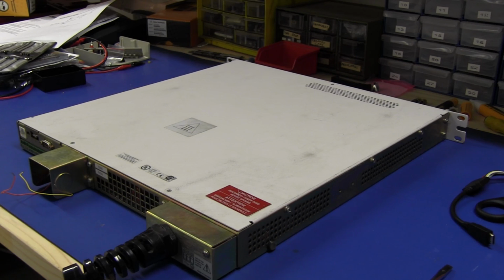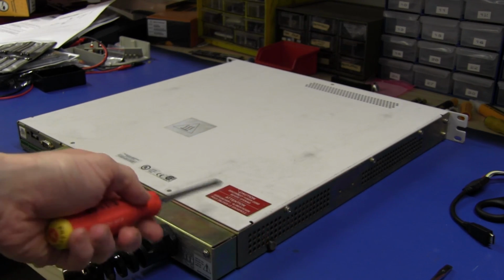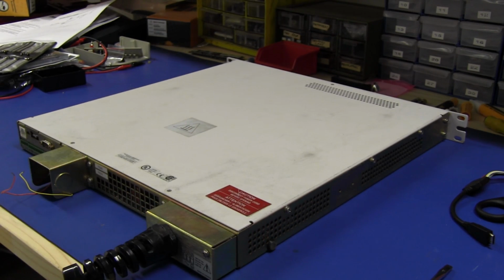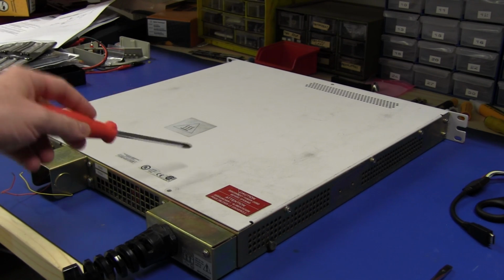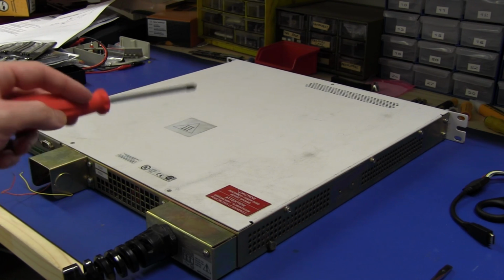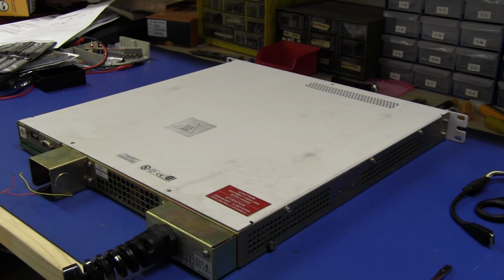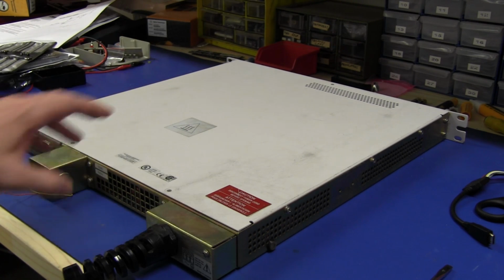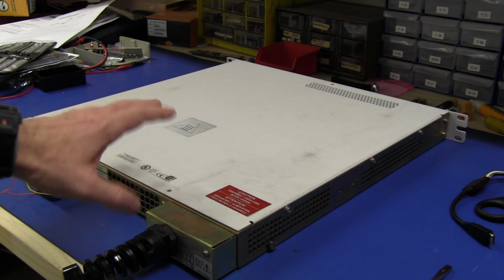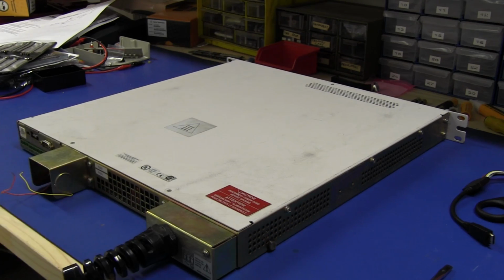And you know what we say here on the EEVblog, don't turn it on, take it apart. But there's a very good reason why you don't want to switch these things on before you take them apart, because lots of high voltage, high energy storage caps in here, so you really want to let those discharge before you take apart something like this. And any well-designed supply like this Xantrex one, top quality industry reputable brand, I'm sure it's got discharge bleed resistors in there.